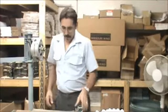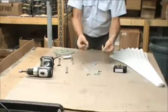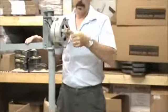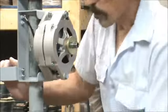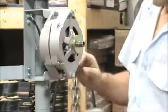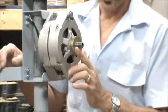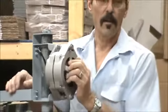And the way we're going to do that is you have the bolts for the hub. Now the long bolts, they're like 1.25 inches. What you want to do is take your nut off the PMA right here, the lock washer. And this is a hub stabilizer spacer that we had designed. We designed this and manufactured this quite some time ago. Anyway, that goes on, and this gives a good back plate for your hub to set against. Stops any hub from bending or whatever.